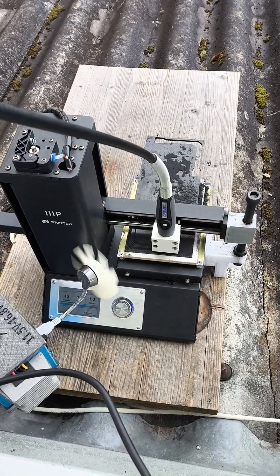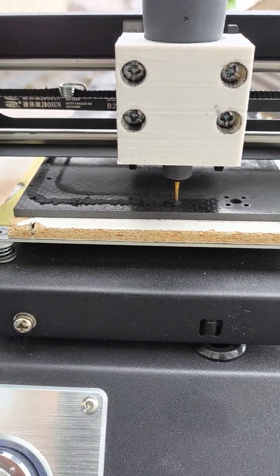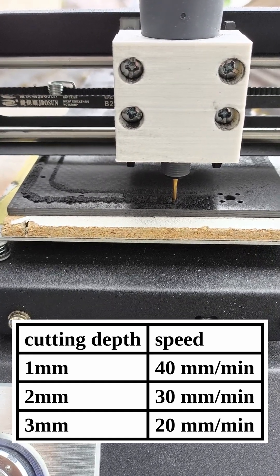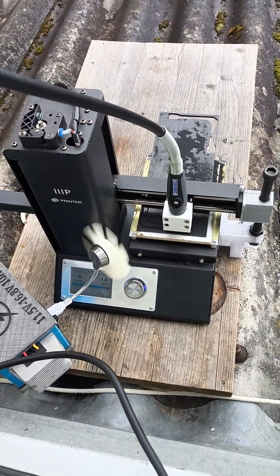The fan is to blow dust away. Your crappy CNC can only handle a small bit — 1.5mm works great. Cut deep but go slow; 20mm per minute fast and 3mm deep is a good start. Keep the Dremel tool at full speed. Carbon fiber eats bits like crazy, so change them regularly.